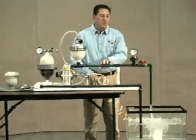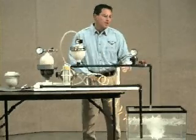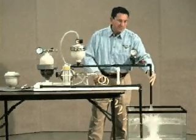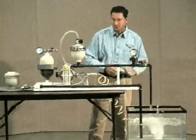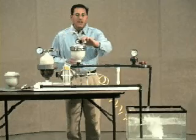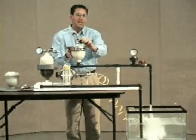This flow is a pump by itself without the dampener — pipe vibrating, pulsating flow that is foaming and splashing the product. Now I'm releasing the air that's inside the dampener, and I'll begin to tune it in.